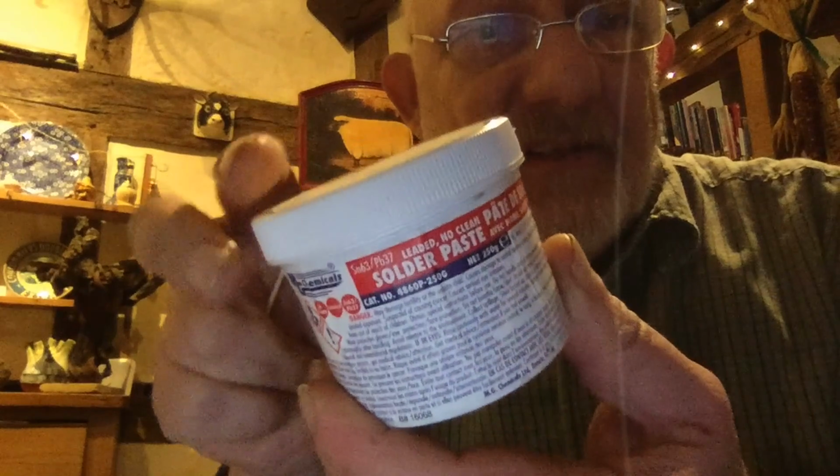So what you do to start with is you make sure the board's nice and clean, and you get some of this. Now, this stuff, when it's cold, is a real pain. So you take this out and put a little bit on a piece of glass, glass is the best. And then you use the hot air gun that you use for your shrink wrap. You just play it on the board a little bit to warm the board up. You can use the one used for paint stripping, but keep it a bit of a distance away. Otherwise, it will melt everything.